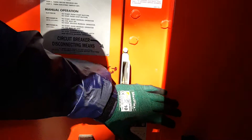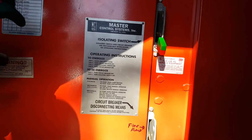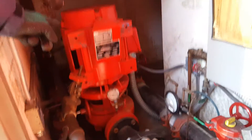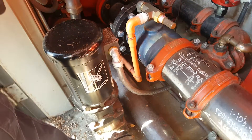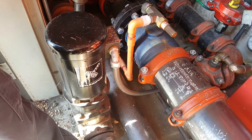So we've got our circuit breaker, and then we have our isolation switch. Now we've cut power off from here to the electric pump, and you don't have to worry about that pump kicking on while you're doing testing. Only the jockey pump here by my left leg will be going on and off to help recharge the system.